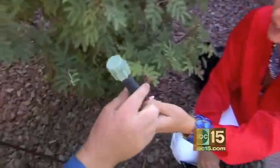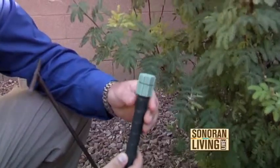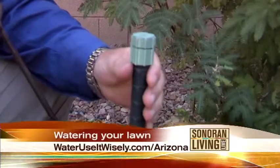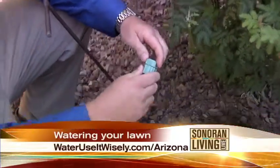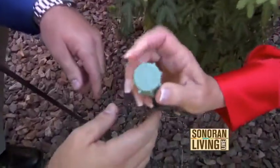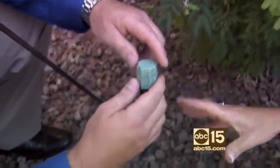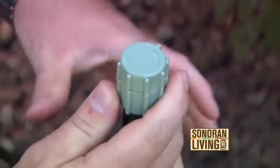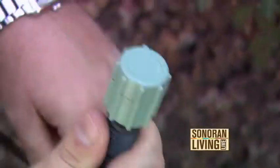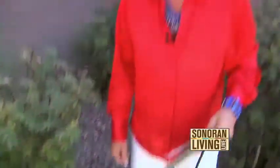One of the things we often see, especially in older model homes, is this bubbler. This is an older-style irrigation device usually found around trees, and it puts out a whole lot of water in a short period of time. That's okay if you're watering a large tree with multiple bubblers over a large area, but the problem is you just don't know how much it's watering. It has a little adjustment on top, so if you open it up all the way or twist it halfway, you still don't know exactly how much water is coming out. It's much better to transition from these over to emitters like a ten-gallon-per-hour emitter, and use multiple ones rather than putting too much water down in one spot too quickly.